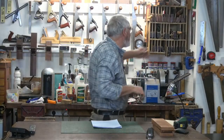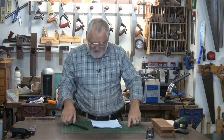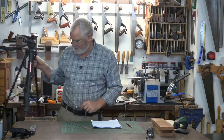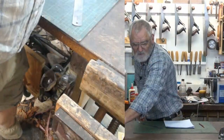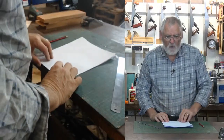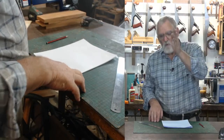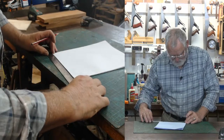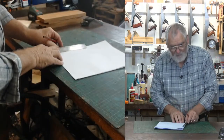So, how they work it out, and I'm going imperial here, people, so it's not because I've got grey hair. It's because this is what the dovetails are actually based on and how they get the ratios. Let me move a camera around here so you can see. Okay. Now a 6-in-1 is the same as a gradient on a hill. It's 6 inches up, 1 inch in. So if we come in 1 inch on this piece of paper, coming in 1 inch, and we're going up.